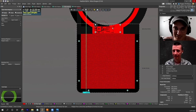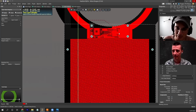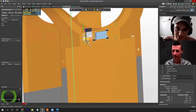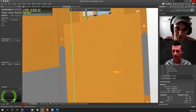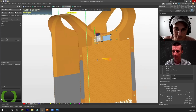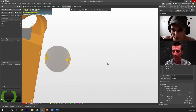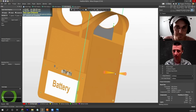So this works: it basically has a temperature controller over here, and then it has this thermal track that heats up. It's like a resistor that heats up, and it goes all the way to the back. You had to calculate the width and length, the resistance mainly. So from the resistance I got the width and length of the track.